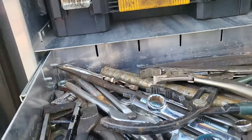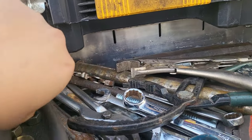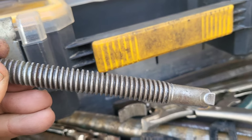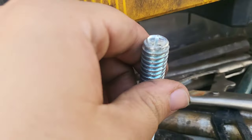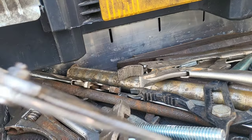These are all the basic tools we have for towing. This is called a caging pin - this is what you stick inside the brake chamber if you don't want to hook up air. There's a bolt and a washer on the other side and you just tighten it down until the brakes are no longer touching the drum anymore.